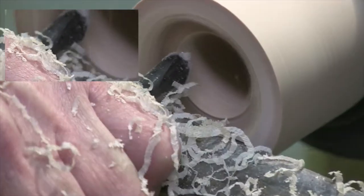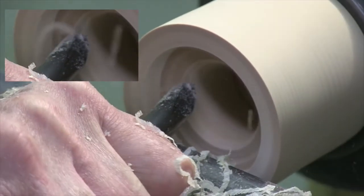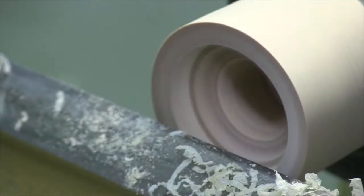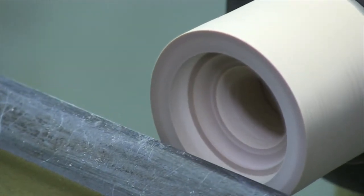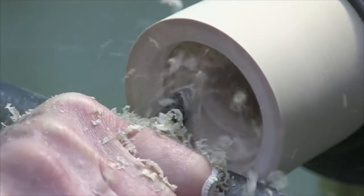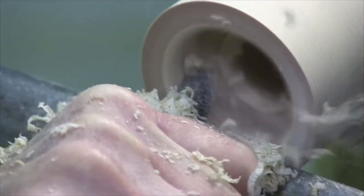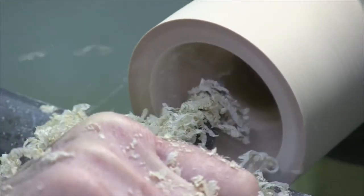How cool is that? This happens to be a Hunter Osprey with a 6 millimeter cup carbide in. Any good? They're great. They work. I'm a tad high. You notice I'm laying it over and you're shear cutting with it. I notice you have a tilt of it. 10:30 there? Yep, about 10:30. But you can see it removes plenty of material, and that inside is nice and smooth.